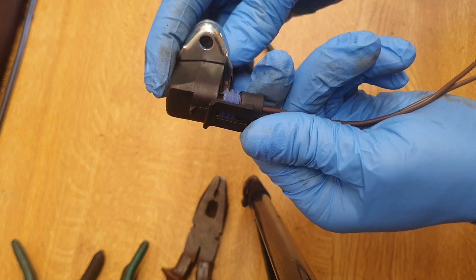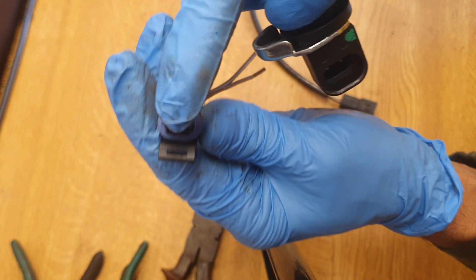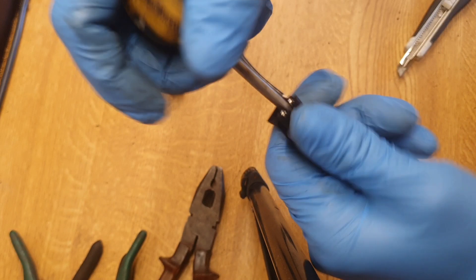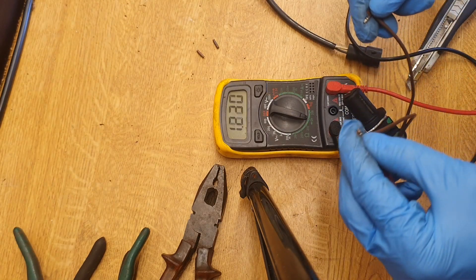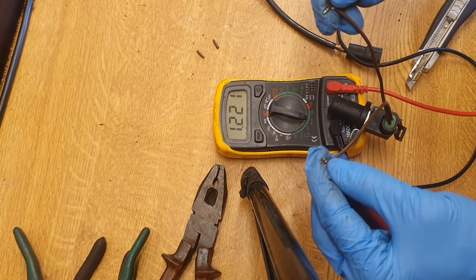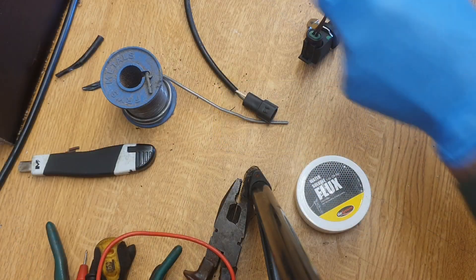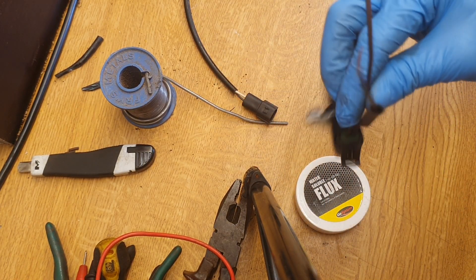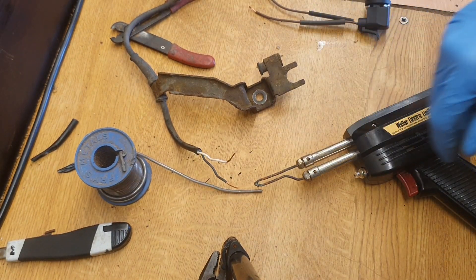For this to work, this is the tail that goes in there, but those pins are too far apart so I've got to cut it down there, bend those apart and try to get it in. There we are, that's connected. The Bongo ones are normally higher resistance - about 1.6 to 1.8k - but apparently this works. I'll put a bit of sealant on there so it stays in and get this soldered together with shrink shield. My dad's soldering iron again, got some flux.